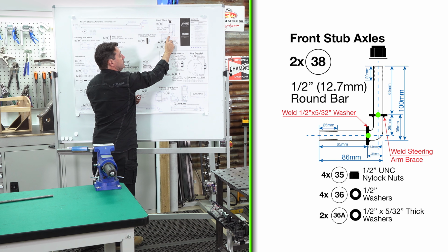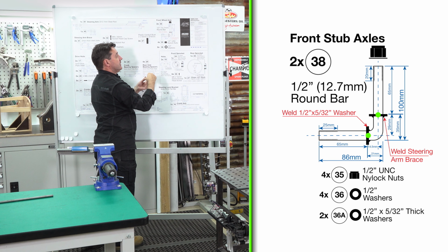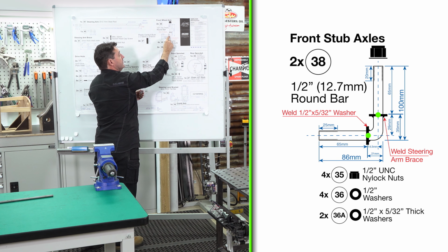Then we'll be using engineering washers as stops where we can then mount it onto the chassis. The last step is we'll be using dies and we'll cut threads so that we can then attach to the chassis and lock it with a locking nut. This is where our wheel is captured, and we also will be threading that face as well.